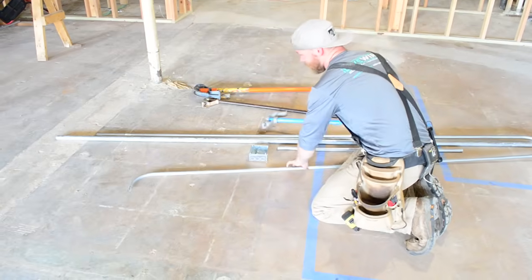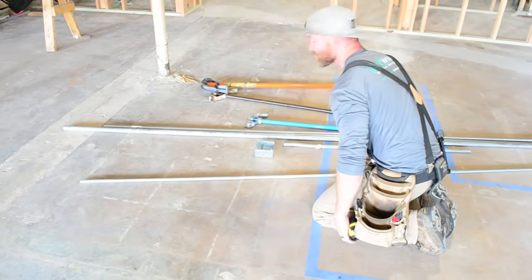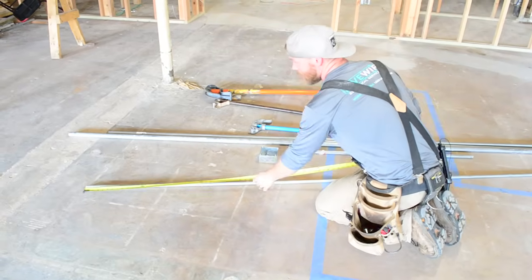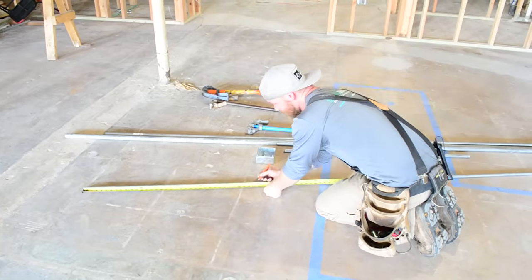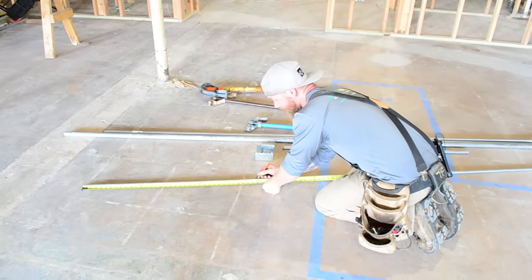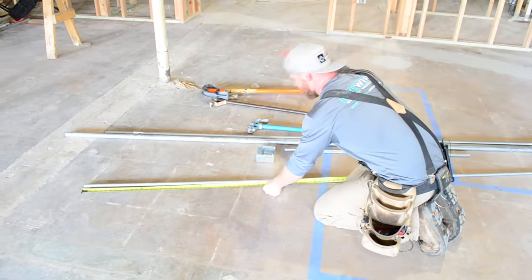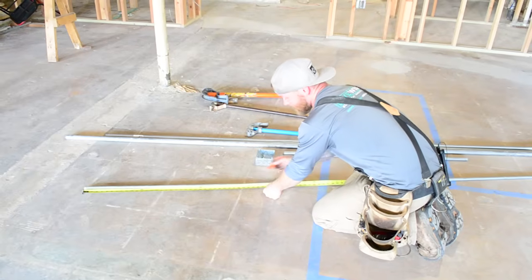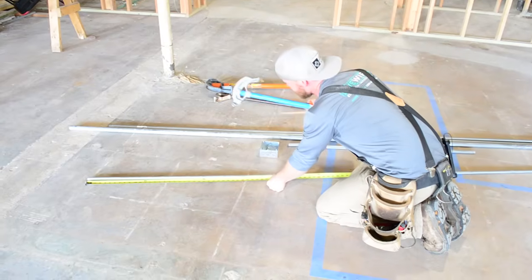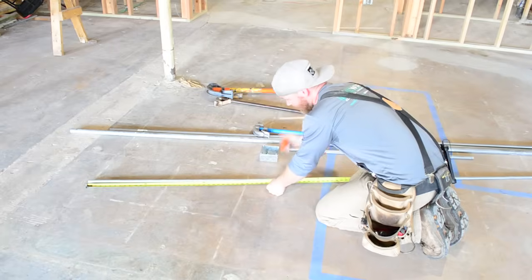Next thing I'm gonna talk about is a forward 90. That's what I call a forward 90. I don't know, there's probably some other better term for it out there, but the reason I call it forward 90 is, say I want a 90 to be at 36 inches. For some reason, I've got a wall or something at 36 inches away that I need to 90 up against. Well, what I'm going to do is measure to 36 inches, and then take off 5, because again, remember this thing says stubs 5 inches to the arrow. So we need to take 5 inches off.